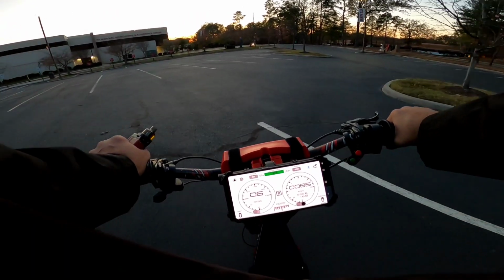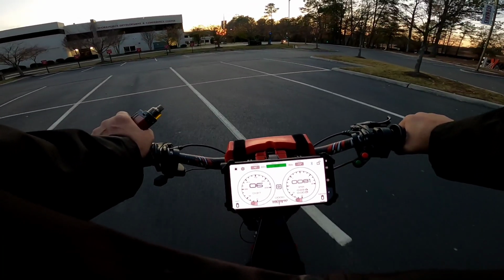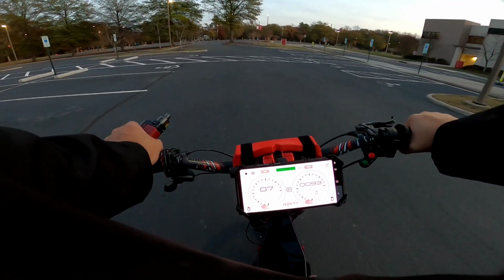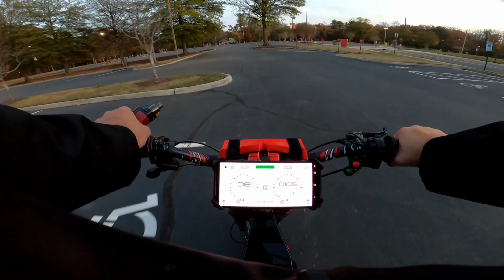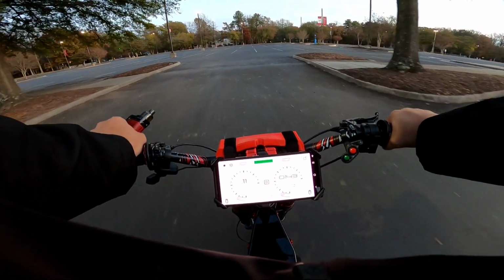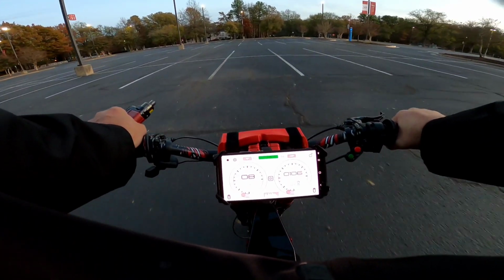Anyway, a dummy load is almost the same thing as a discharge system, where you have to put your battery under load, and that's the only way you can discharge those cells. So you can make yourself a discharge system, but with these big batteries, like I said, you're gonna need a big old resistor.